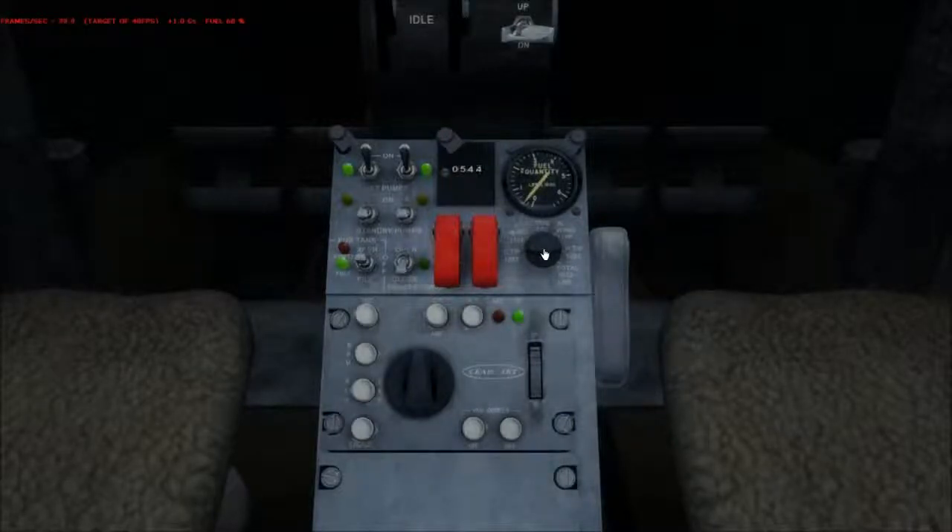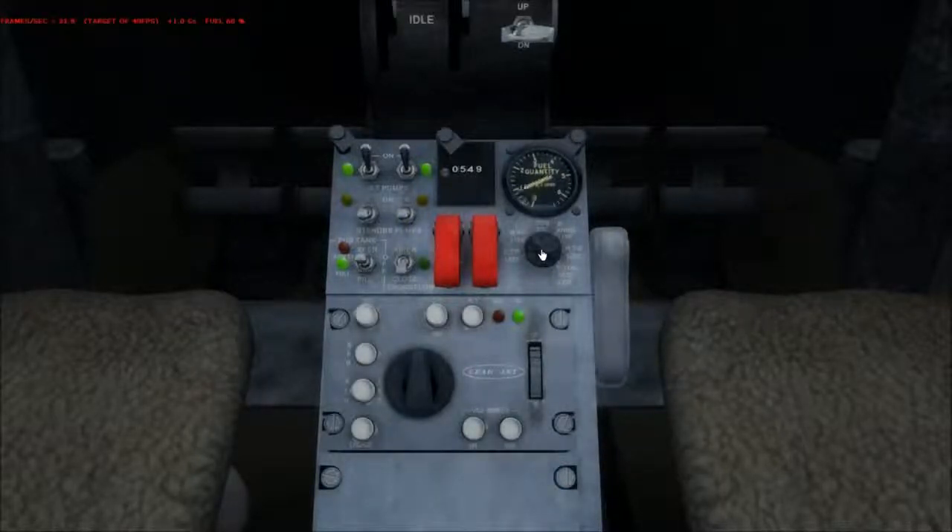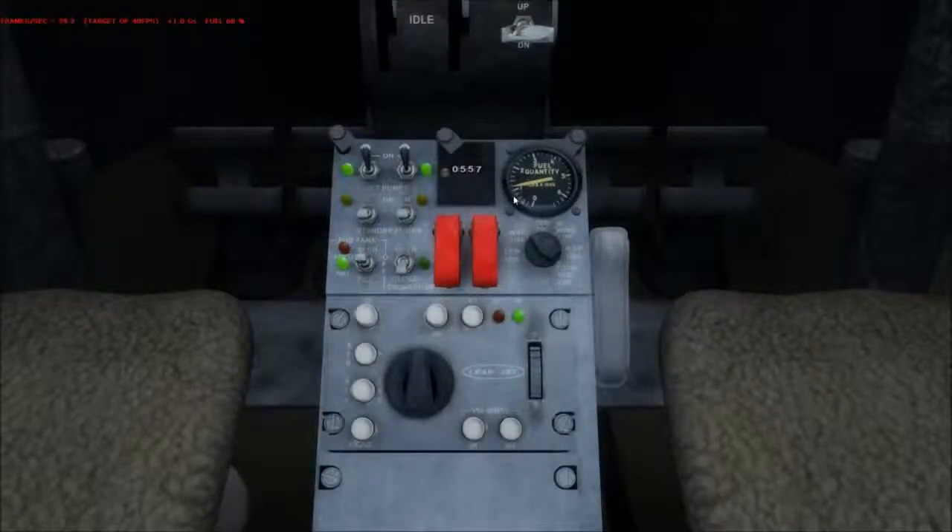This dial shows you each tank's amount of pounds of fuel remaining, and it also has a total. So you need to keep a close eye on your wings. On a long trip you'll want to leave it on one of your wing settings. There are notations for the maximum amount per tank — on your wings you should have 1,160 pounds, so you'll know when a tank is still full.